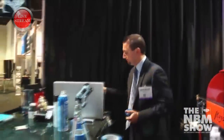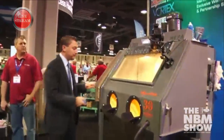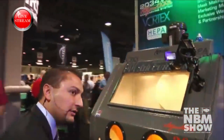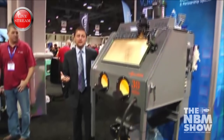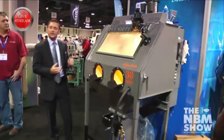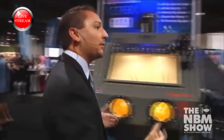I'm going to go ahead and head over to the blaster. What I'm going to be using here is our 2034 VXA — this is a self-reclaim adjustable system. What that means is it will adjust your height, so if you have several people in your shop with different heights you can adjust the cabinet accordingly — ergonomically, you don't have to bend over the whole time. Not only that, but this system recycles the sand automatically. It pulls all the dust to the back while keeping all of your good sand back into the system to be reloaded into your pressure pot, so you don't have to waste abrasive.